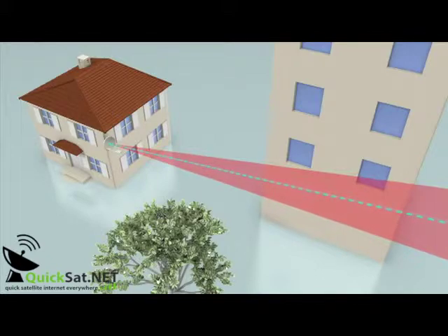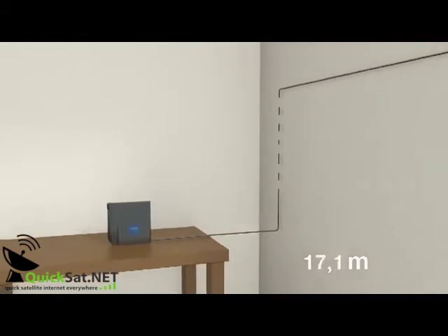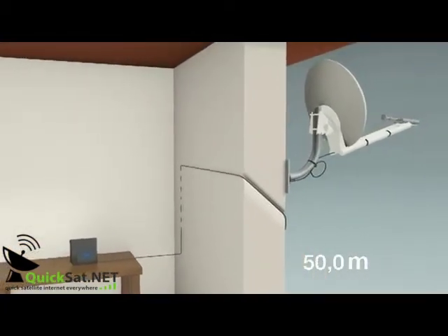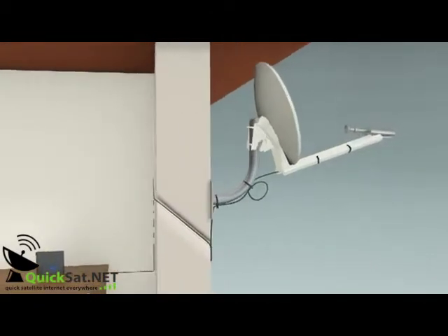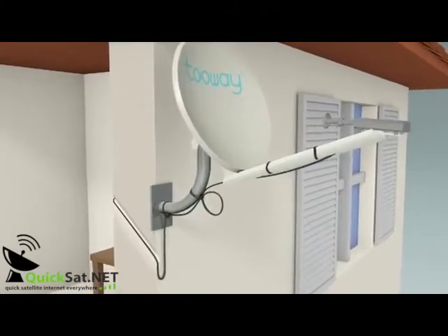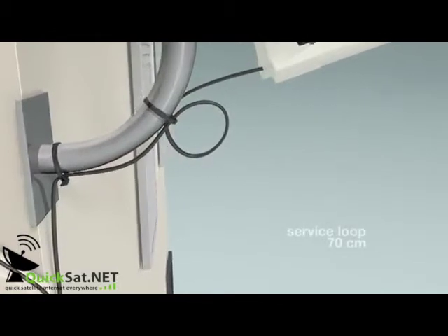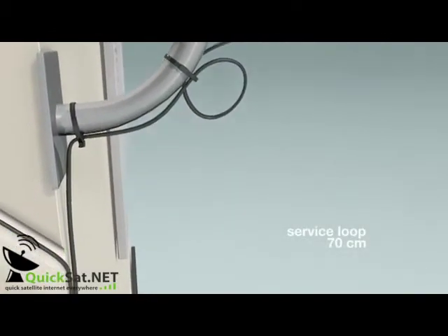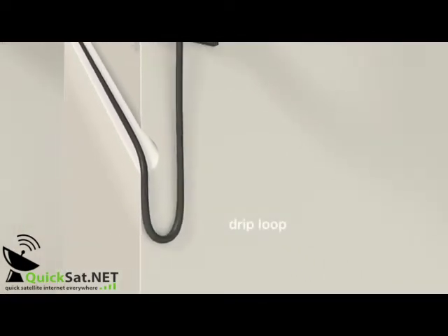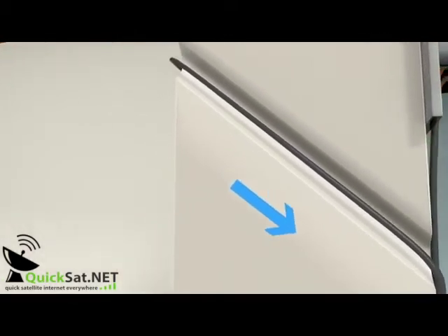The final criteria for choosing a good installation position is the maximum cable distance between the antenna and the modem. The maximum distance is 50 meters but can be longer depending on the type of cable. When cabling the antenna, leave a service loop of about 70 centimeters to enable the replacement of connectors. At the point of entry to the building, put in a drip loop. When drilling the hole in the exterior wall, drill down at a slight angle to prevent water penetration.